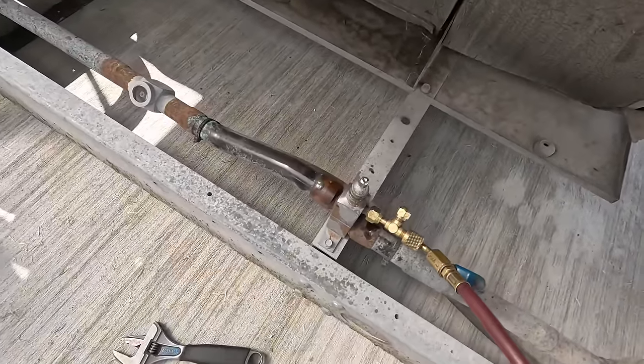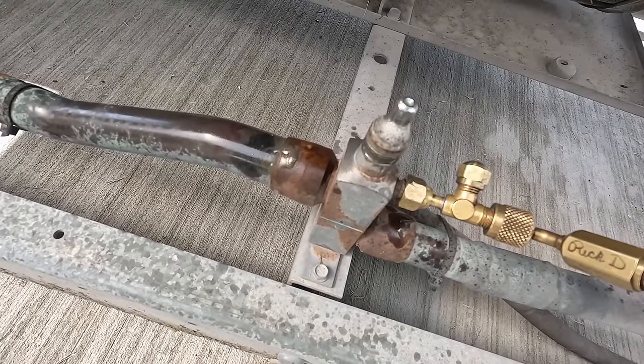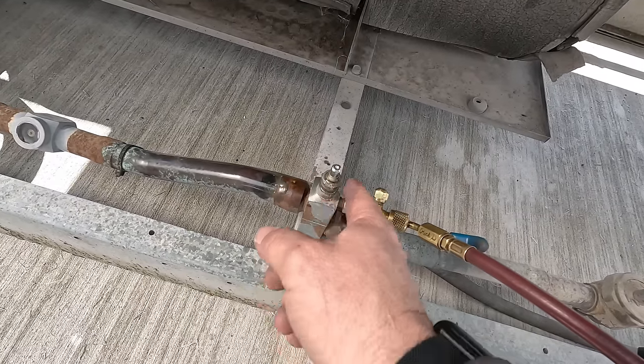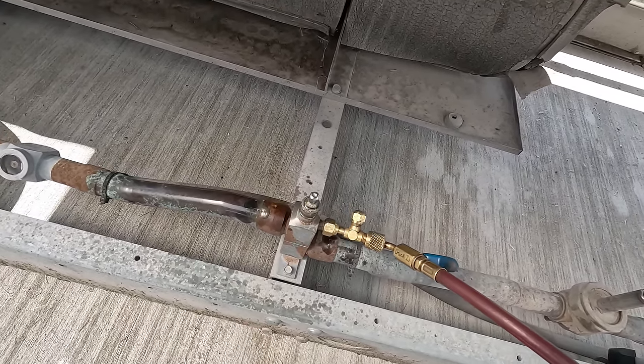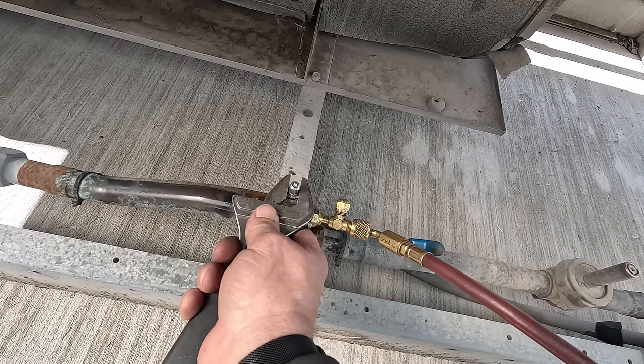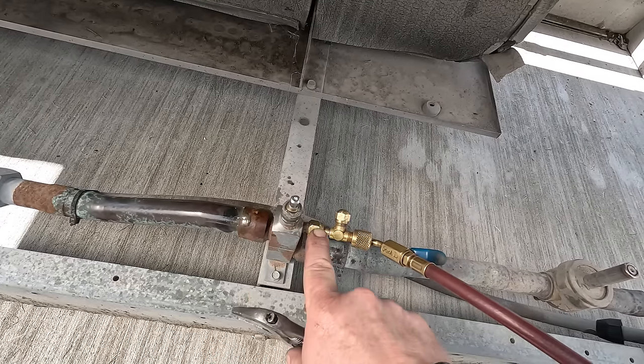Spray a little oil on that to see if we can get the cap on a little snugger. It's really encouraging when the oil's bubbling on top of it — no leaks here, bud. No leaks at all. Nothing to see here. All better now — no leaks now, all better. Didn't feel like going back to the shop and grabbing the big bottle, but basically that's what we probably needed. I was able to tighten that packing nut, sprayed it with soap — went ahead and sprayed my filter dryer, some of the other fittings down there. Sprayed all my high side stuff over here, a little fitting down there on the discharge. Sprayed my receivers up here.